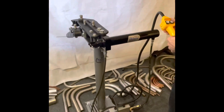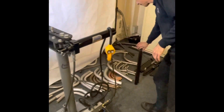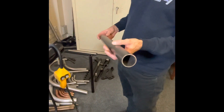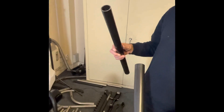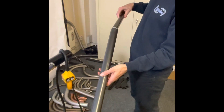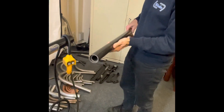I'm just going to show you a quick bend to see how it works. We are going to be bending some 42.4 CHS by 3mm wall. And just for a little bit of extra fun and to give the machine a proper test, this is 33.7 CHS by 3mm wall — we're going to slide that inside. Get the seam nice and lined up.